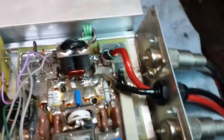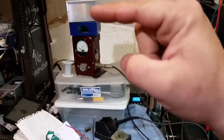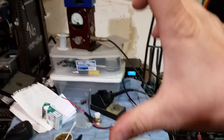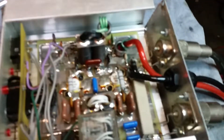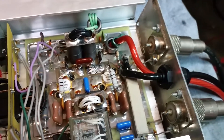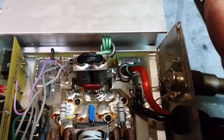We've now got about three times more inductance on your power wire, which is going to help keep that RF signal off. You've got DC power — if you look at it on a chart, 27 megacycles being here of AC RF electricity, DC being here — they are two different sides of the spectrum. But you can have 27 megacycles and DC on the same exact power wire, and you want to keep that RF off that power wire as much as possible. You'd have to do a crazy filter network to literally eliminate it to zero, but we're trying to eliminate it to tolerable levels. That's why it's good to add around 20 to 40 microhenrys of inductance to your power wire.